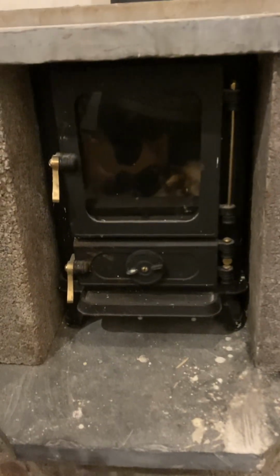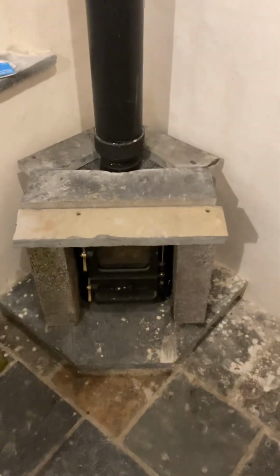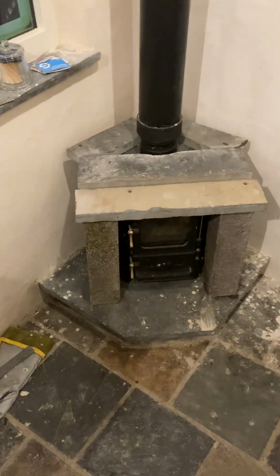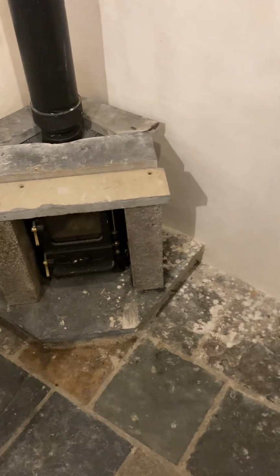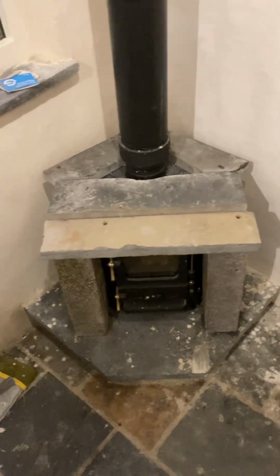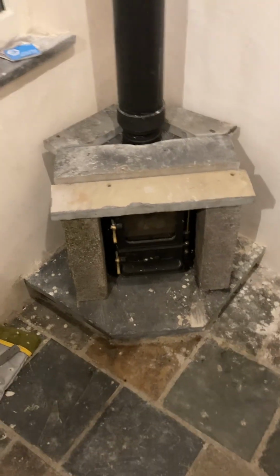So that's the protocol. And then I've calculated, I think, for the amount of masonry I'm going to be able to pack around this thing, I should get about 600 pounds of masonry basically in and around this hearth footprint. So 600 pounds of masonry, I'm hoping, will store heat enough to keep this room comfortable for the 8-hour workday, so that I only need to burn a single box full of wood at the beginning of the day.